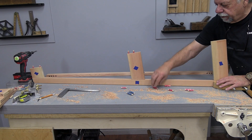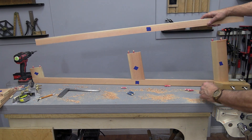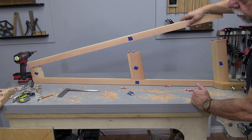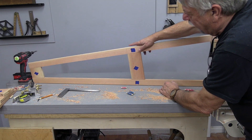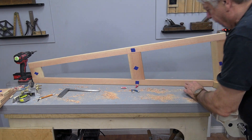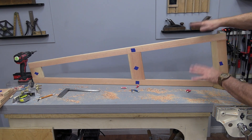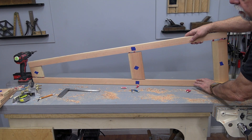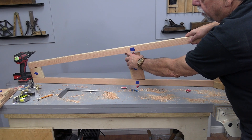I'm just doing a dry fit here. If you're new to my channel, you're probably asking why I'm using those red dowels — that's because I made them a little bit smaller. If I use the regular dowels it's too tight to take apart, so I use dowels that are a little bit loose, sanded down a bit. I've got two different sizes: blues and reds. But look at that — everything fits perfectly together. Now I just need to take it all apart and start gluing it all together. I'm not going to make you sit through all that gluing.